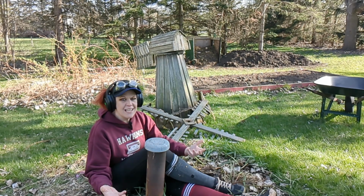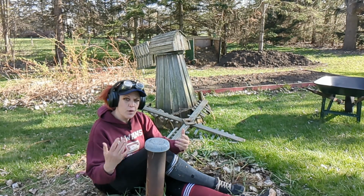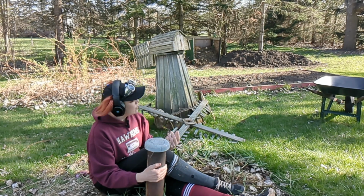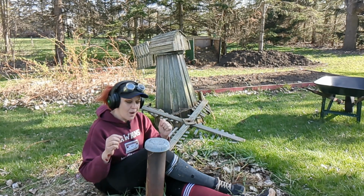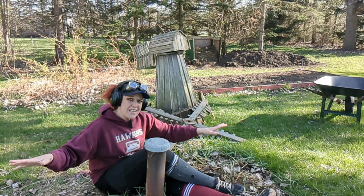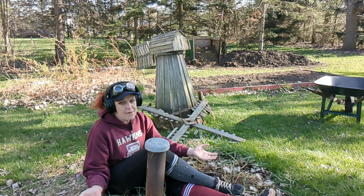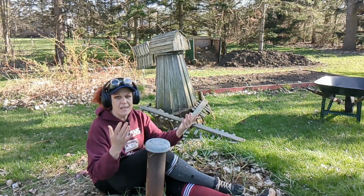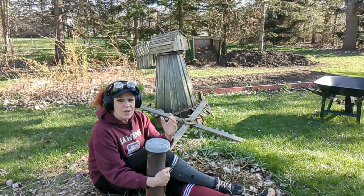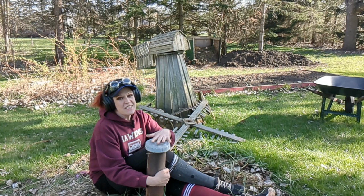And the reason you see a lot of these decorative well and septic covers is kind of twofold. So putting a loose cover over the top of this still allows that gas to vent out into the atmosphere, but at the same time, it prevents additional contaminants, grass clippings, the whole 9 yards. If this loose top gets knocked off, you don't want to get a whole lot of stuff, especially in your well, because that's your drinking water. Now, this one goes to septic.